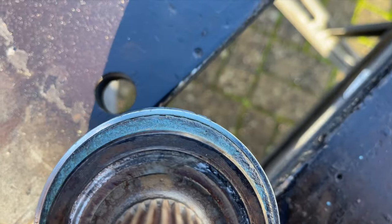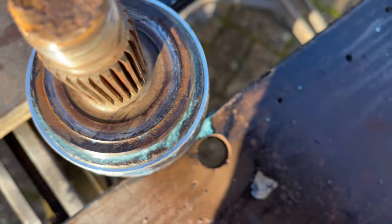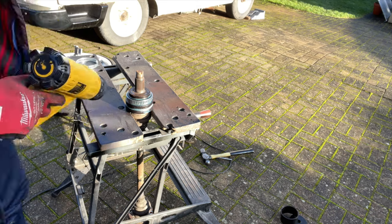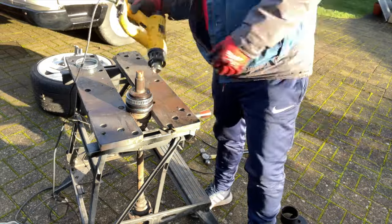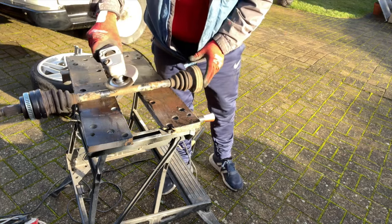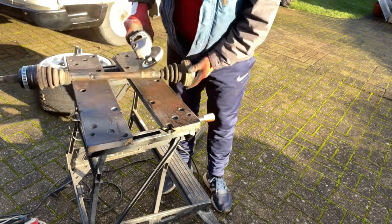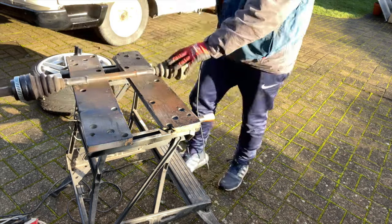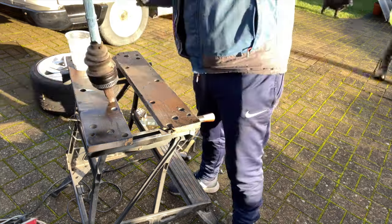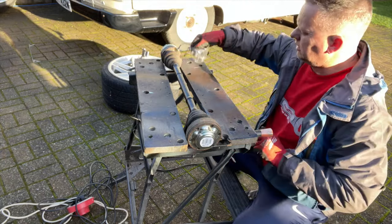There's a small light bleed just there but the rest of it is absolutely bang on. Get a blow on that and just dry it off. This PVA does go off pretty quick once you start getting a bit of heat on it — just give it a quick blow, warm it up there. Then we can finish off the shaft — clean that up as well, get rid of where it's got a powder-coated paint on it. Grind that off where it's lifted. Then we can do the same with the Aqua Steel on the rest of that — give it a good coating, and that'll seal it all up and stop it rusting in the future. Get a heat gun on it again, dry it down. All done — it almost looks like new. So well pleased with that.